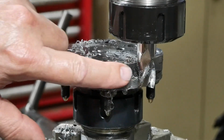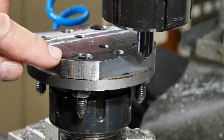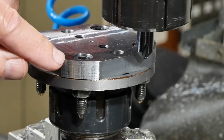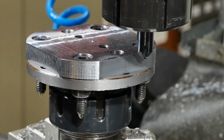So that finishes rounding the corners. Now I've got to do chamfering all around the top edge. Don't have a lot of experience with doing this sort of chamfering, but I've just done a test pass with a 0.2 depth of cut, and I want a bigger chamfer than that. I've reset the depth to 0.4 and we'll see what that gives us.